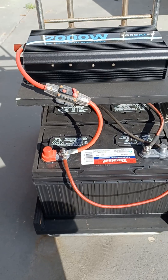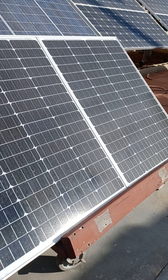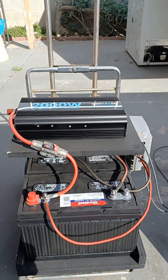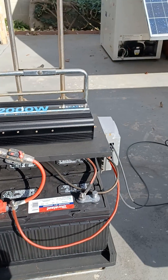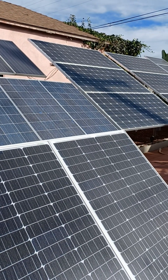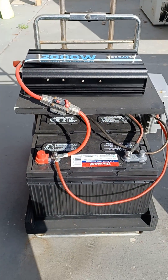This is your basic survival setup. It's powered by two 100 watt solar panels connected in series into the controller. You can expand from there — you can connect as many panels as you want in order to maintain whatever you need. Right now those other panels are grid-tied, but this is a totally offline, off-grid system.